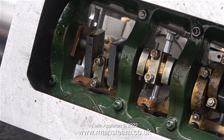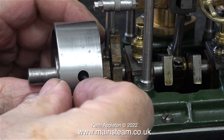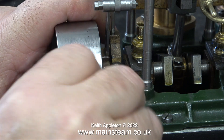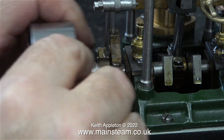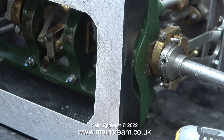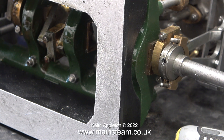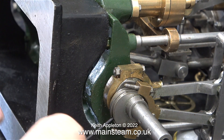After running the engine using the electric drill I checked it out - here's the underside view and everything looks okay. The only part of this engine that has had the timing set correctly, or hopefully correctly, is the centre cylinder. The timing on the high pressure cylinder and the low pressure cylinder is definitely not right. There is a hole in the bottom of the eccentric strap and this allows an Allen key to be fed in to tighten the eccentric sheaves, which are made in pairs onto the crankshaft. With the bottom part of the eccentric strap removed you can clearly see the Allen grub screw - this makes timing adjustment far simpler. I really hope I got the middle cylinder's timing perfect because it's not quite as simple on the middle set of eccentrics.